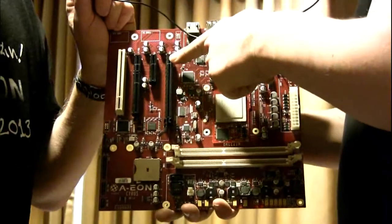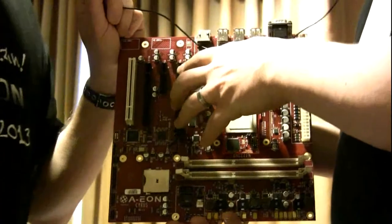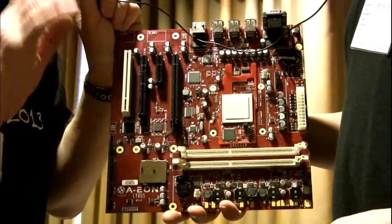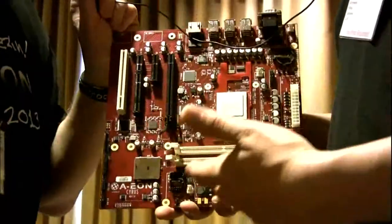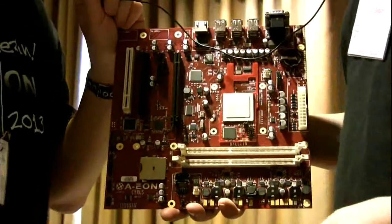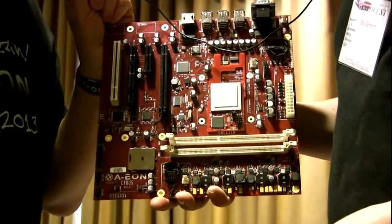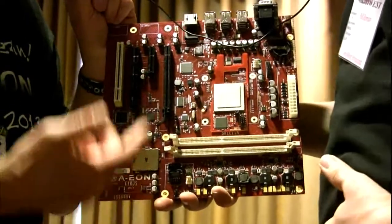My understanding is a lot of the modern video cards actually have audio capability built into them. They do. Is that supported today? Under Linux it is, yes. So it's a driver question. That would be another way of users getting a sound card, by using a high-end video card that has sound built in. Yes, I've tested about 15 Radeon HD cards in my X1000, and under some of the Linux distributions, you do see this audio output on the sound card.